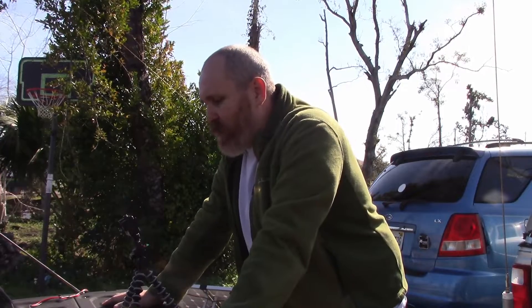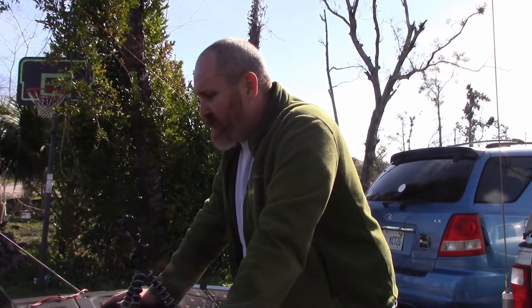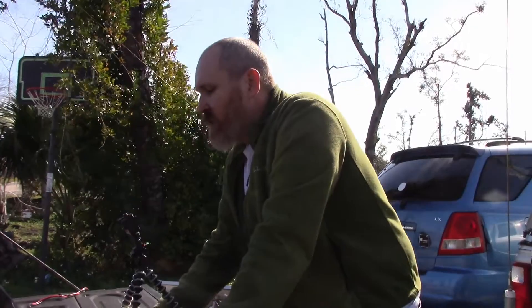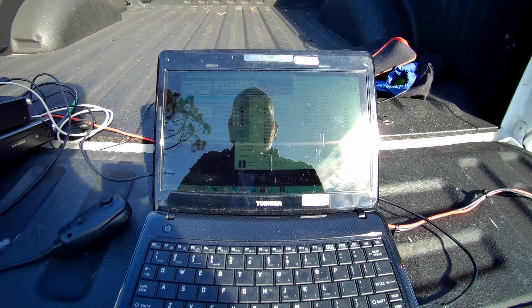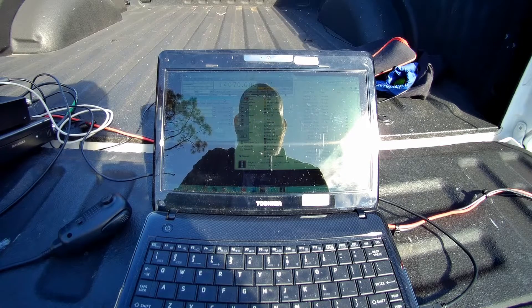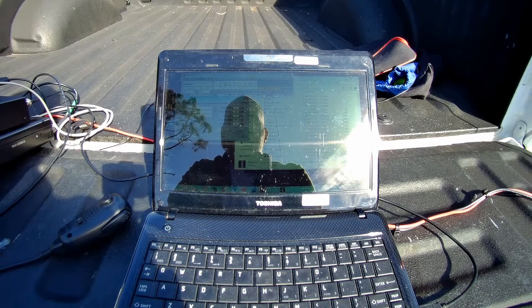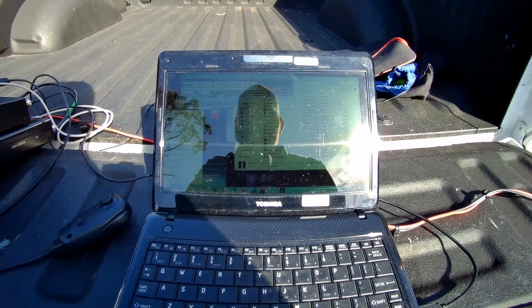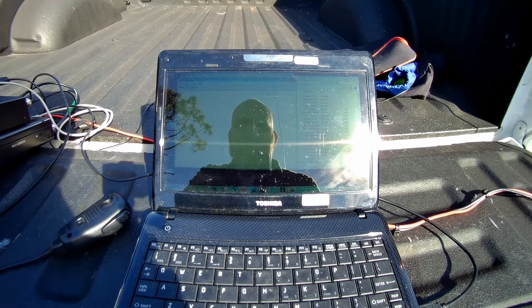The glare on the screen makes this hard to film, but let's talk through it — maybe I'll redo this inside with more detail in the future. To get FL Rig set up, go to the config menu, select Setup and Transceiver. I'm using FL Rig version 1.3.39. That allows you to select your rig — FT-891. You'll need to check your COM port settings; you can find those by searching for Device Manager on your computer.